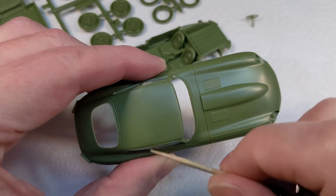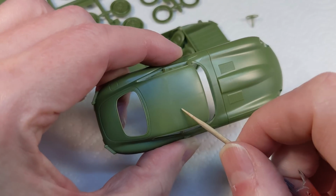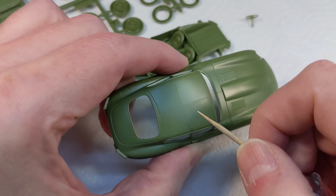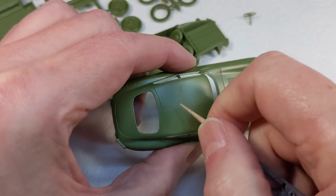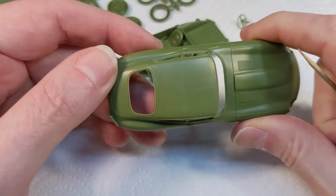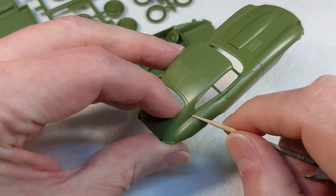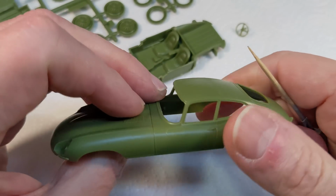There's a very odd pattern in the plastic. Well, I think that is just a pattern in the plastic. I think that's basically showed you where they've injected the plastic. Does that pick it up? Oh yeah. So you've got like a cross in the roof, but this is where the plastic has been pushed in from 4 different angles, and this is basically where it's met, which is kind of cool to see. So it's perfectly smooth, but there is a pattern there in the plastic. We have another lovely mould line here that runs along the roof and then down the rear wing, and I'm assuming that's going to be the same on both sides, which it is.